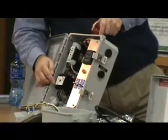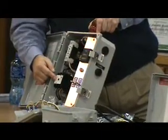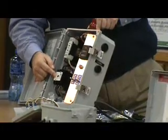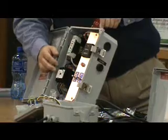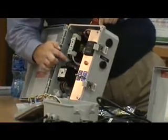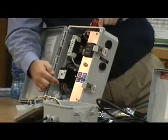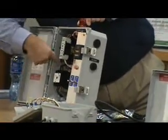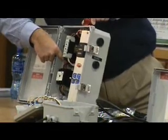I did not touch on base on this one. I talked about NEMA and IEC, but this is a definite purpose contactor. In pumps where you have the overload built into the pump, there's a possibility you'll see this definite purpose contactor. You'll see the large wires coming into the 2 terminals here. These are your power connection terminals. And it's kind of difficult to see, but down on the top here is your control circuit, that coil circuit that I showed you.